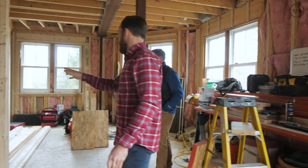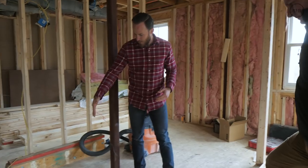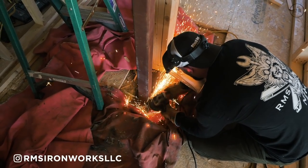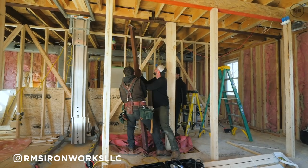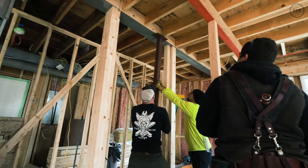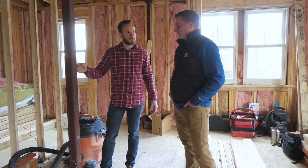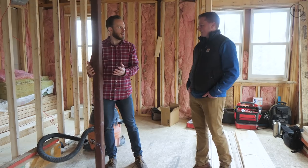This post over here also moved — about 30 inches. Prior to the move it was kind of in the middle of the span of this beam, and now it's right on a connection point. It was actually going to end up right in the foyer area — when you walk into the master it would have been hanging out in the middle of the room. We moved it back and now it's just inside the closet. We're really restricted on where we could put it because of structural steel down below, but we got it just inside the closet and we'll make modifications to the millwork to hide the post — wrap around it and detail the shelves.